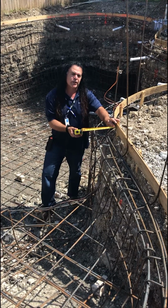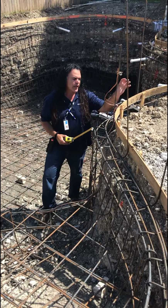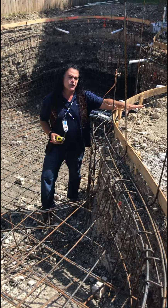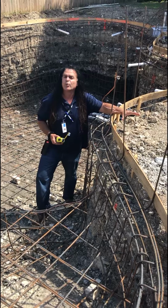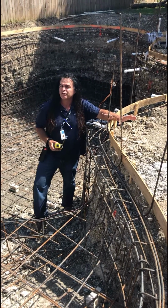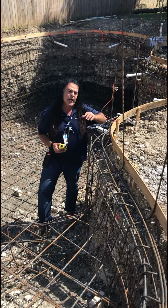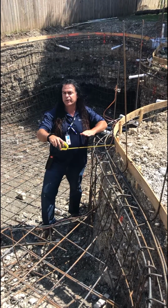One of the things that you really got to be careful for is disturbing compaction rate around the pool shell. Once you disturb that, it is very difficult to make that compaction rate sound the way it was before. In other words, you will have catastrophic failure of your pool shell moving and shifting if it is disturbed, i.e. overdug more than it needs to be dug here.